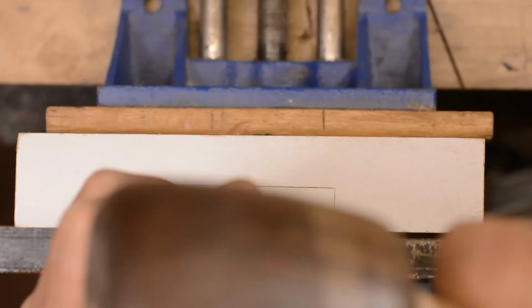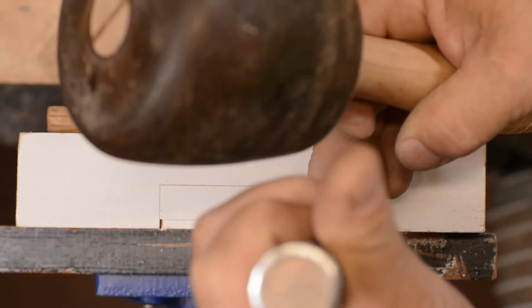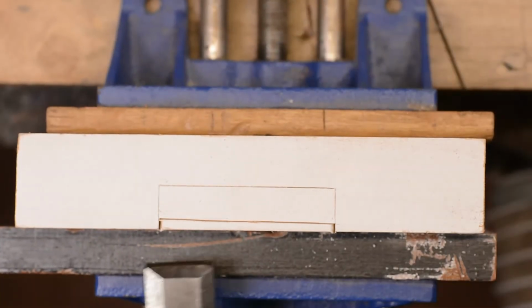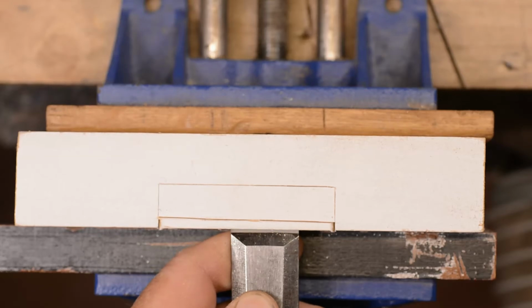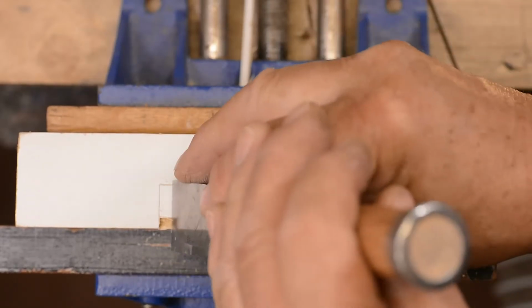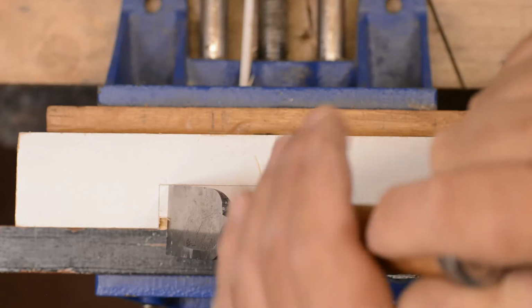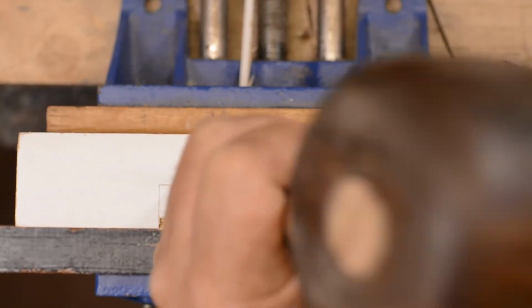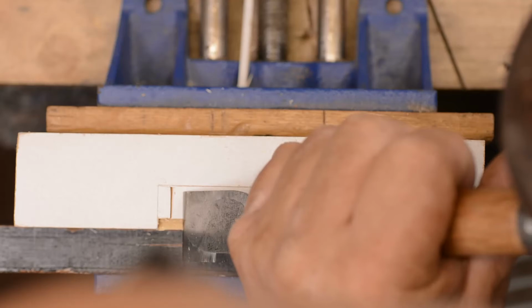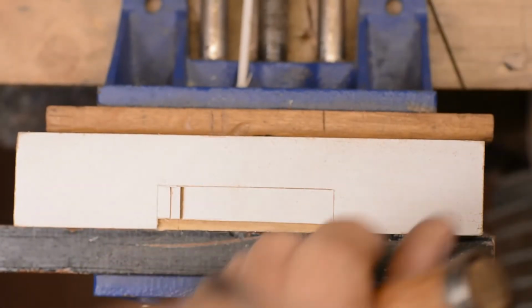You need a very sharp chisel. And what I'm going to do is just chisel the inside of there, just 2 little marks. Chisel the little piece out. My hands are shaking a bit, but that'll do. And then just get the edge of your depth. Right. So when you chisel out, you need your chisel fairly square to your door edge. The idea is to chisel, and then when you just start seeing the mark on your cutout there, you know you've gone to the right depth. But this, it's just on there, I've got quickly underneath.